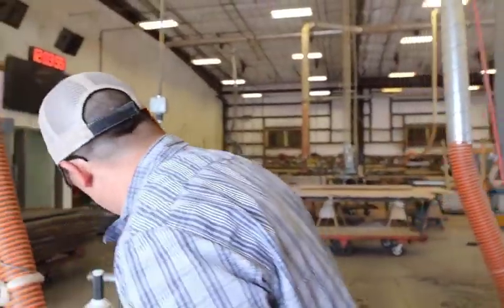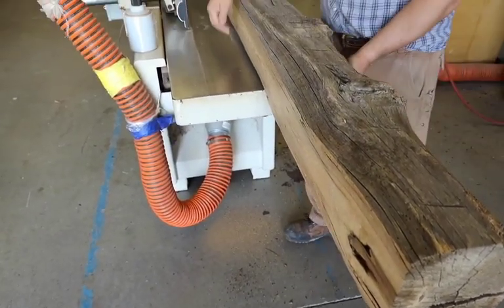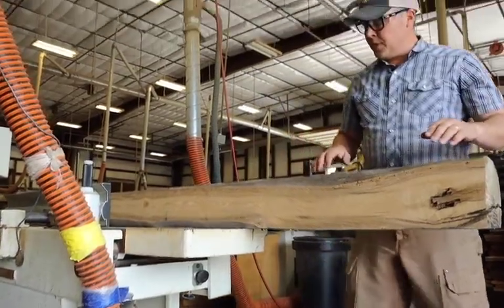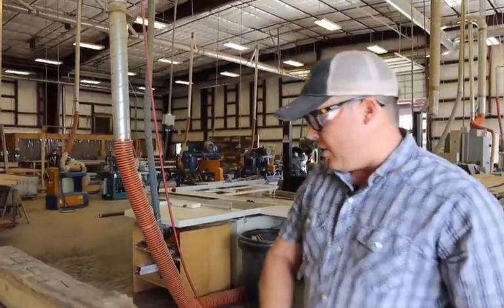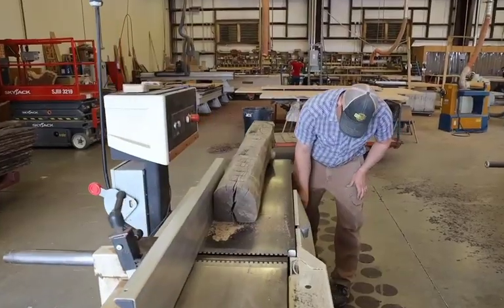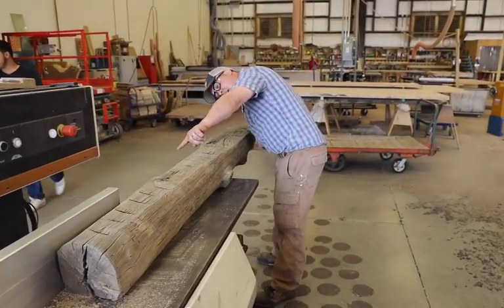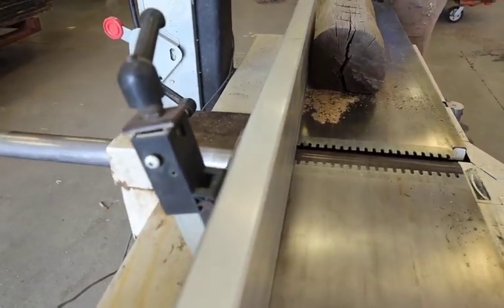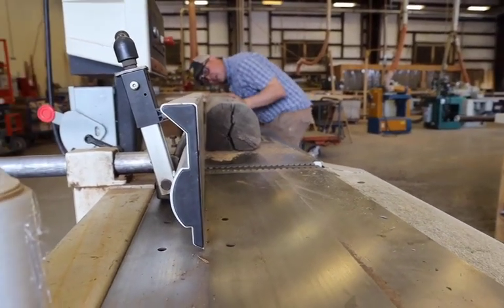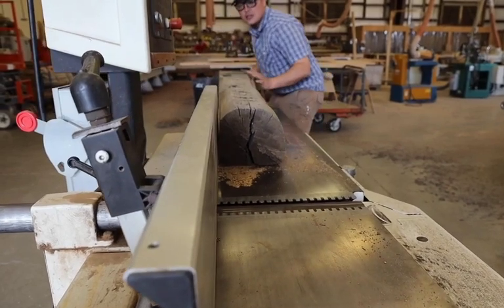Let's take a look — we're getting close. I have a lot more surface area here where we're going to put our cleat. Probably got maybe one or two passes and we should be good. Next I'm going to use this side and start flattening out one of these edges. I don't want to take a ton off, I just want to get it flat so things can sit on it. I was running it pretty hard — I'm going to take it to about an eighth of an inch. If you shoot down the fence you'll see it's not quite square. The top part is not lined up at the bottom, that means it's not square. I've got to push it to square it up to the fence.